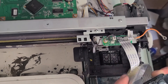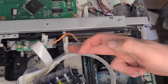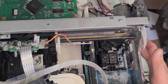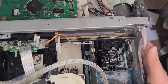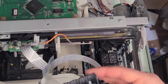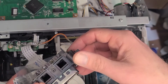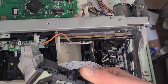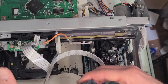That's removing your printhead out of the Epson 3880, which from what I can tell is pretty much the same as the P600 and the P800. Make sure your wet cap station stays intact. Slide it over so you can see that's what's underneath it. When it's wet capped, it presses up against it. I oftentimes remove this out of the way and I've done printer flushes as well on these printheads by just moving it over on my DTG unit. But if you're running a DTF printer, you're not going to have the ability to do that — you're going to have no space to work with.